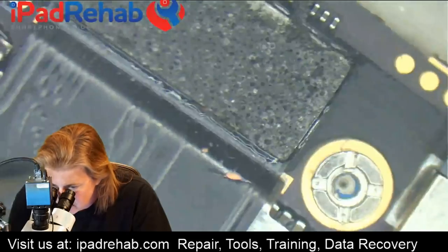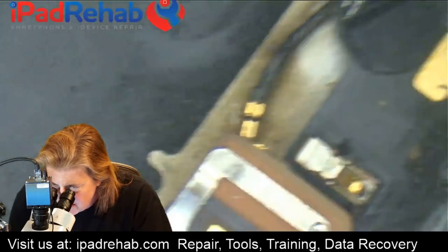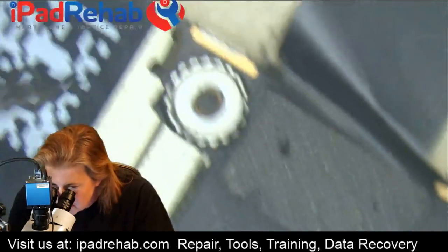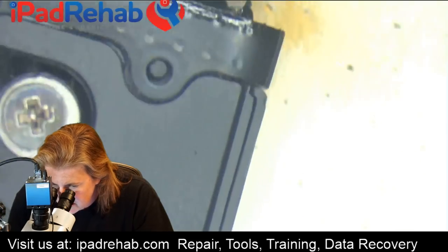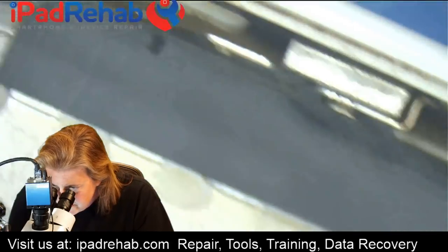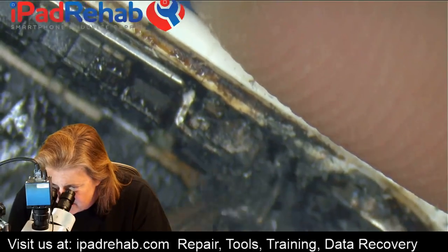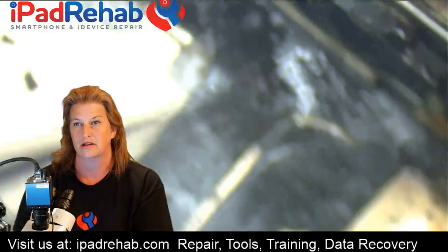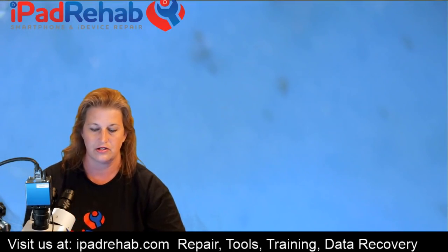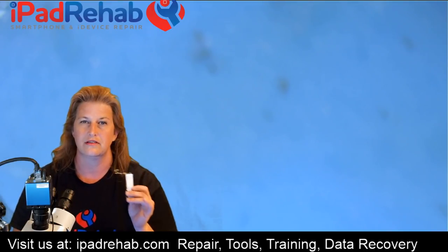Much of it's fine — this all looks fine, the SIM itself didn't bubble up, totally looks fine. As far as the logic board is concerned, I would notice this damaged chip and be concerned, but on the top side there's nothing about the logic board that would really jump out and say definitely microwave. The housing though really doesn't lie. The damage is very focal — this time the fire was up in the top corner by the vibrator motor and really spared much of the board.